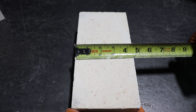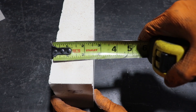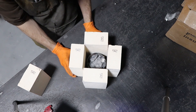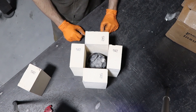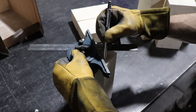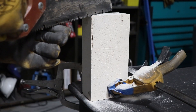These fire bricks are 4.5 by 9 by 2.5 inches thick. At first, I wasn't sure how big I should make the furnace. A simple square or rectangle might be good, but it wouldn't be enough room for the crucible that I wanted to use. So I went with a pentagon shape that seemed to work really well and gave me all the space I needed. I worked out the angles I needed, and then in order to cut these bricks, I used a handsaw.